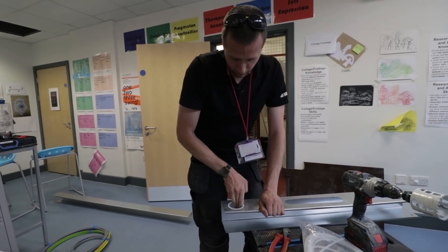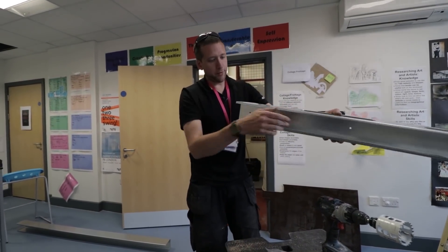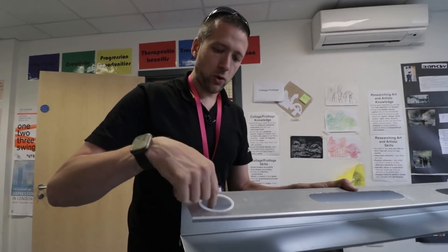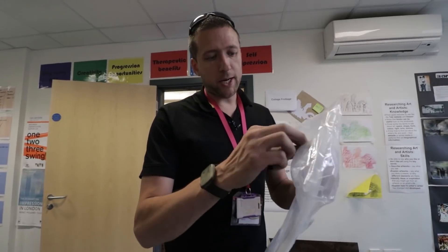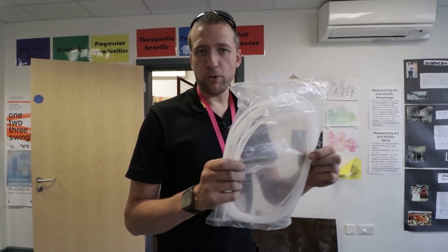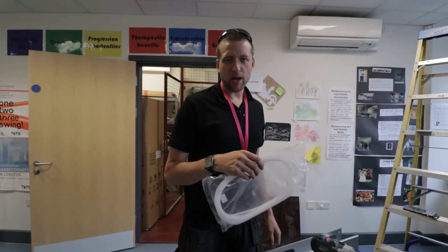You can buy this protective strip — I've just cut a 64mm hole and put this in to protect the cables when they come in. You can buy it in lots of different sizes; this is 1.6mm, and you buy like a 10-metre length for a tenner. Just keep it on the van — I've got three or four different thicknesses on mine. Properly good stuff — you can buy it on eBay or Amazon. Cheap as chips.